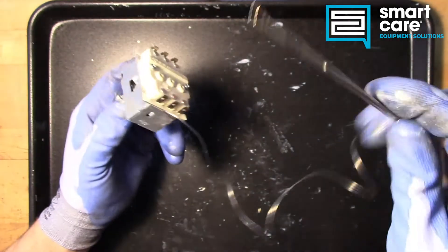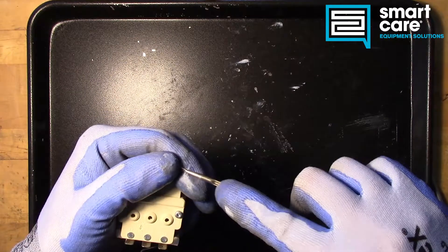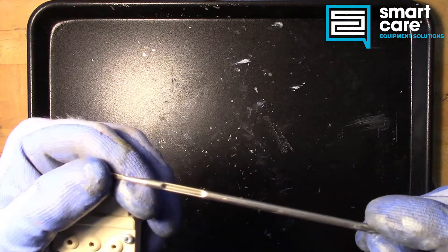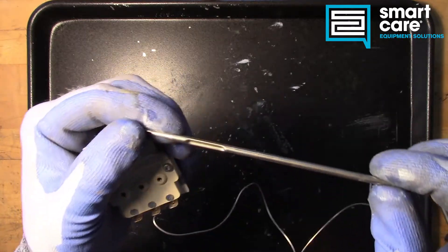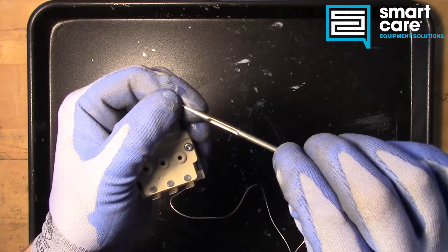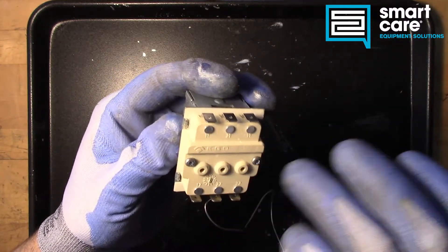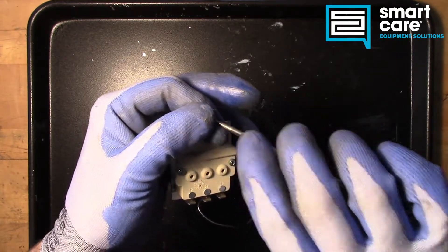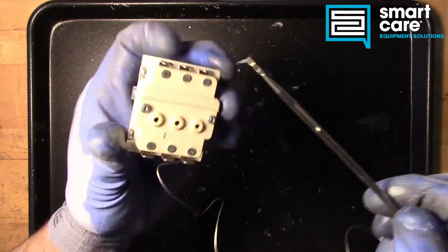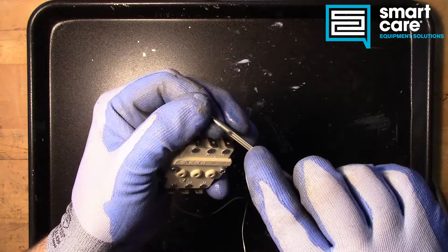Taking a look at the outside before we pull it apart, you'll notice that the probe has been crushed. That's intentional — done from the factory — and it's done to make the device more sensitive. By increasing the pressure in the bulb, you can make these very sensitive so they trip in a very narrow range. If you leave the bulb uncompressed, it'll have a wider range, so you'll see this commonly on high limits.